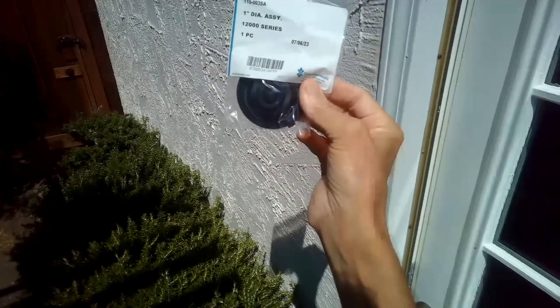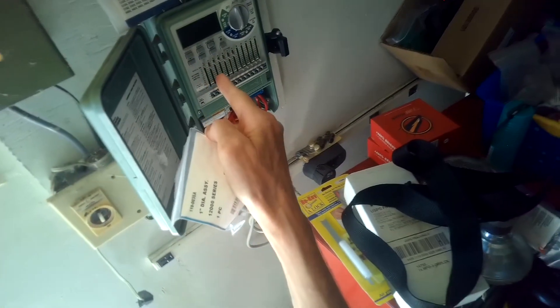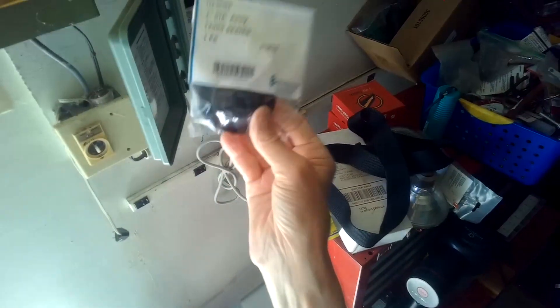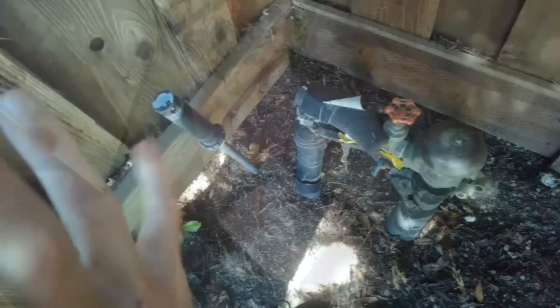What we're going to do is activate one of our sprinklers, then turn off the main water supply. I just turned on one of the sprinklers so it's going to be active, and then I'm going to go up on our hill where we have the water valve for this whole sprinkler system and turn it off. I'm letting water flow through one of the sprinklers as I turn it off, so it takes pressure off the system so I can fix this. I'm shutting off the water supply — fully turned off. I don't want any kind of leak.